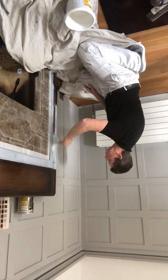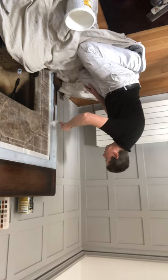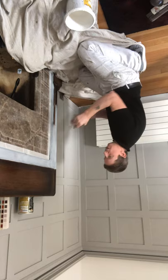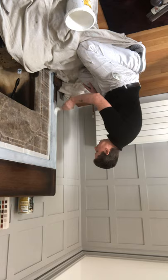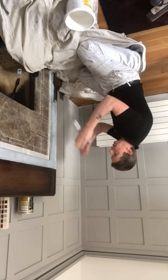This cover stain primer, you can feel how good it is. Even as you apply it, you can already feel how it's really sticking to the surface. And again, as I say, you really have to be quick working with this stuff because it does go off pretty quickly. And that's why, as I say, it is important, if it's a fireplace or a piece of furniture, to do it in sections.